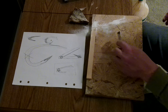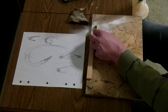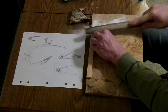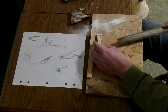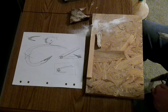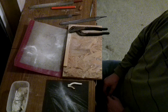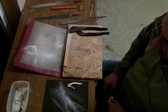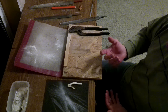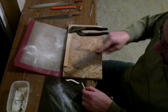The rest of this is going to be just filing it down with a coarser file until I'm close to that line and have the rough-out shape. I'm going to cut the rest of this and start on the filing project off camera and we'll rejoin when I've made some progress. We now have the two pieces of our fish hook pretty well roughed out — I did a little bit more cutting with the hacksaw but mostly this was just a function of filing to the final shape.